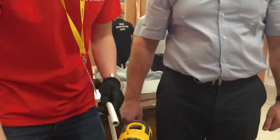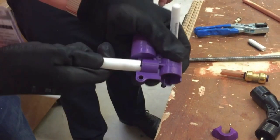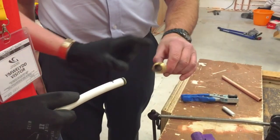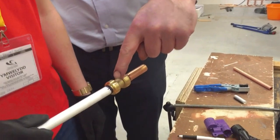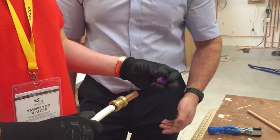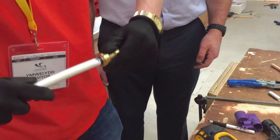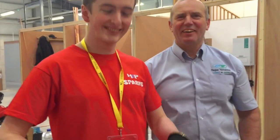So we're going to depth mark it. Then we insert the Tektite seal. There's your pipe — push it in, and you can see that it's gone in to the socket depth mark. Now try and pull it apart, Jack — yep, that's not budging. Now he's going to use a removal tool to demount it. That's it — and just show that we can reinsert it — no problem. Try to pull it out — and there we go. Pretty easy. Jack is now on a new career in plumbing rather than marketing.